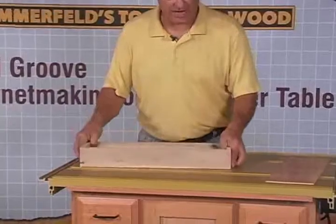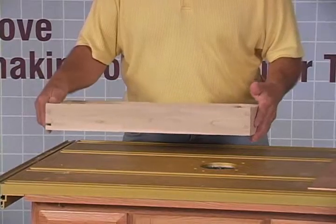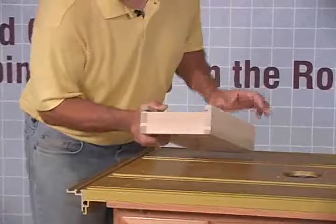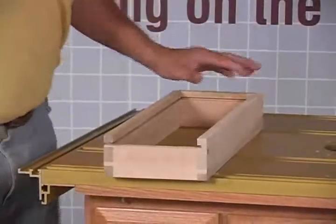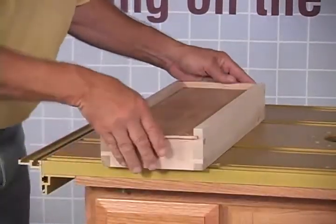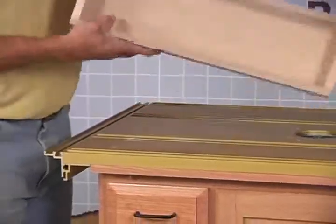And what we've done then is we've actually glued up that drawer. When I hammered that together, we glued up the drawer. Now, what we did on the back, we didn't put the bottom in yet. On the back of the drawer, we cut off 3/4 of an inch. And the reason why is because now we can take that drawer bottom in later and slide it in right like that. And then we can take and glue underneath here. We take and air nail that or screw it, whatever you want, and your drawer is in there.